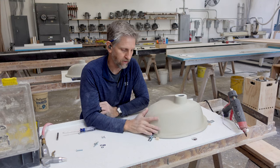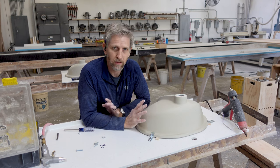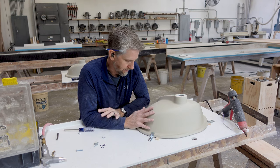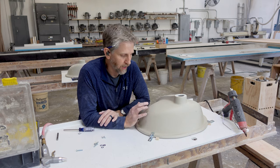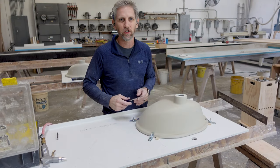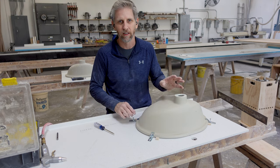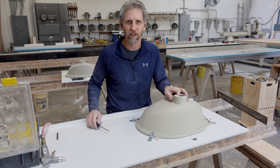Then you have mechanical fasteners that will hold the sink in place, especially while the silicone dries. Once the silicone dries, that's going to be the primary attachment — the primary way that this sink stays on — and it also seals the top of the sink. And that's all there is to it. That's the simplest way I found to mount a porcelain sink to the bottom of a Corian countertop. If you have any questions, comment below. Thanks for watching.